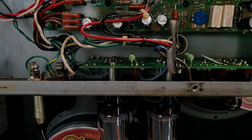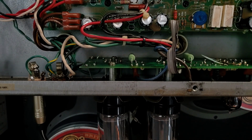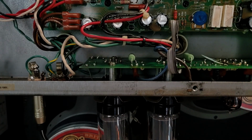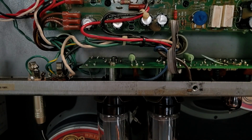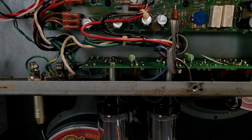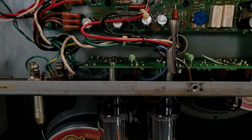Sometimes I'll get an oven mitt for such things, but if I touch this tube, the vibrations would dampen and the motorboating would stop. But this tube had become really microphonic. So he's got a brand new pair of Sovtek 5881 WXTs, which are the same thing as their 6L6 WXTs. They're just branded differently. It's a fine quality 6L6. In 2022, it's one of the best ones that are available on the market right now. And I set the bias at the factory 60 millivolts.